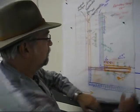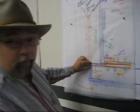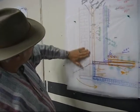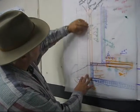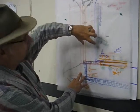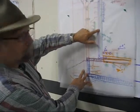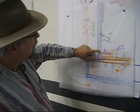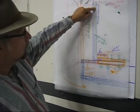We addressed that on the floor system to the wall system by bringing our foam insulation underneath the wall. This is the existing brick masonry wall. Inside of that we've got a two-inch air gap, then two inches of rigid insulation, and approximately eight inches of blown-in insulation. We're also contemplating PEX tubing as part of the geothermal radiant loop — it will obviously be in the floor but may go up some portion of the wall. We haven't determined that yet.